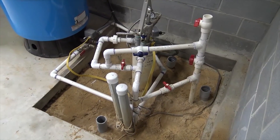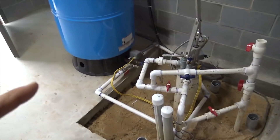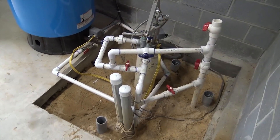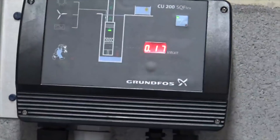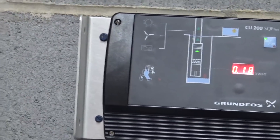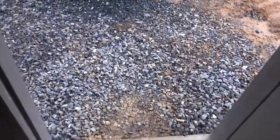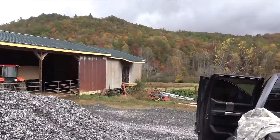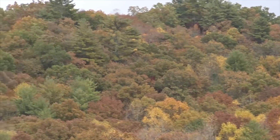It's kind of a Rube Goldberg — it started with all of the stuff in the house, then they decided they wanted it down here, so we had to move everything. If I had to start all over it would be a little cleaner but the function would be the same. On a cloudy day we're putting water in the tank. We've already tested the float switch — when the tank is full, the float switch light comes on and shuts the pump off so nothing gets damaged, and we have an overflow just in case. Lots of backups to backups on this system. Engineer 775 signing out from this location — I think for the fifth or sixth time. Thumbs up for Abraham. Time to go to the next site — the leaves are beautiful, it's been a great place to work.